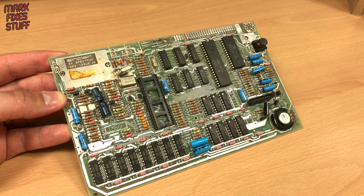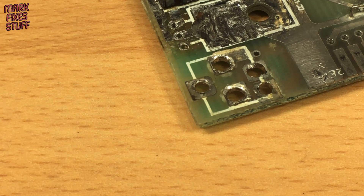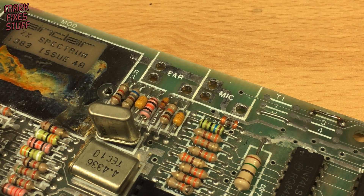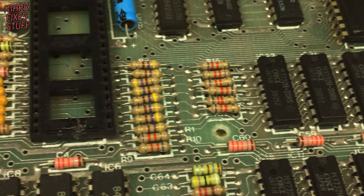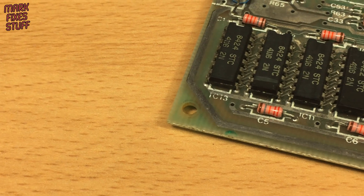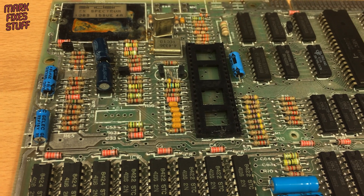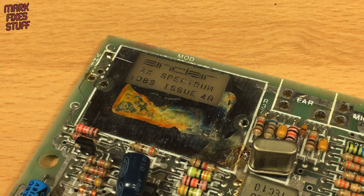But this 48k model 4a has a lot of things missing. The power jack has been hijacked. The 7805 regulator has vanished with a poof. The edge connector is dirtier than an 80s weekend at Butlins. The sockets for ear and mic have taken a hike. Keyboard connector 2 is present, but keyboard connector 1 isn't. The lower RAM is all present, but one of the upper RAM chips is but a lost memory. The ULA chip, which is the beating heart of the Spectrum, is completely conspicuous by its absence. And the modulator for putting images on the telly box has been nicked, revealing an embarrassing understain.